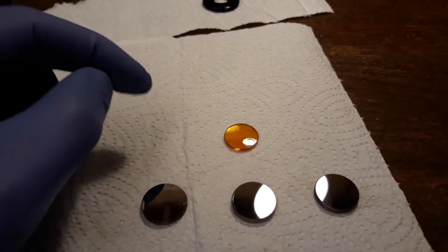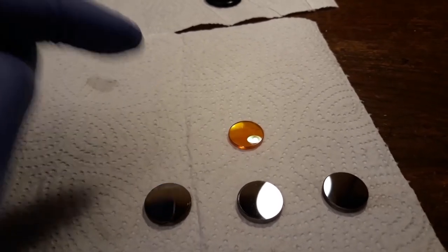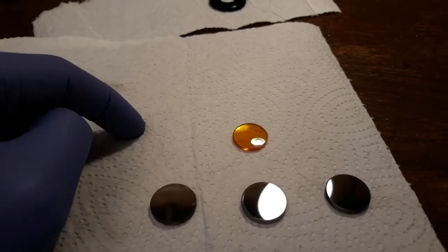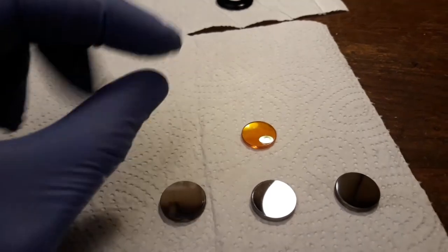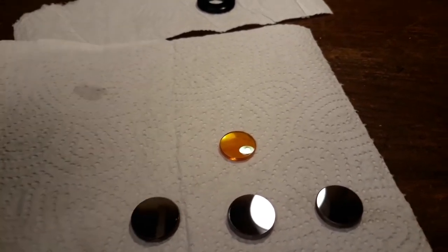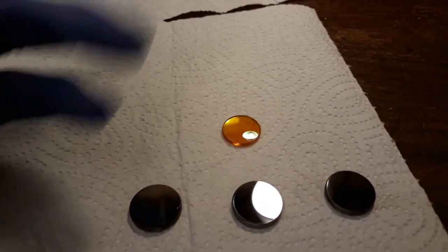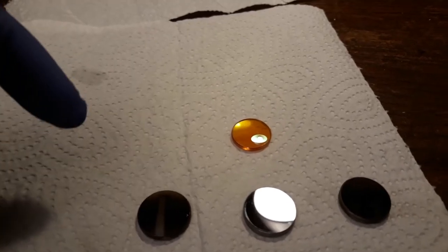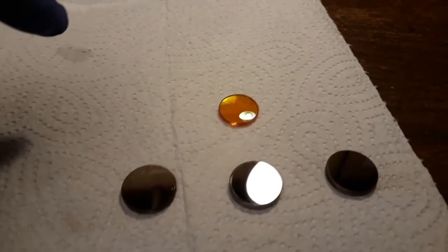And this is going to, depending on the material, probably sublimate the material. So it's going from the solid state to the gas state in one bang, basically. And then we're going to use some pressurized air to just blow the material out. And this is basically how a CO2 laser cuts organic materials, such as wood or PMMA, which is acrylic glass.